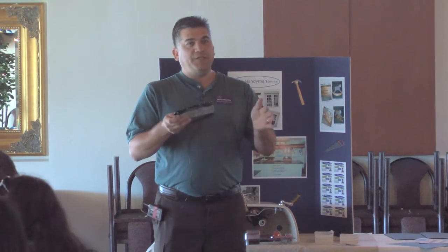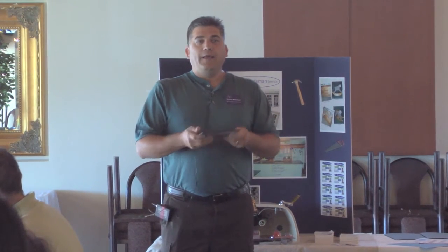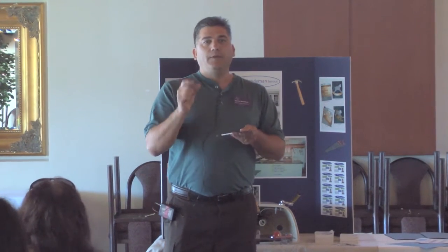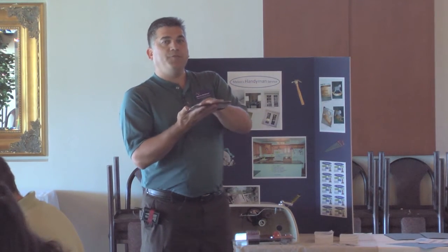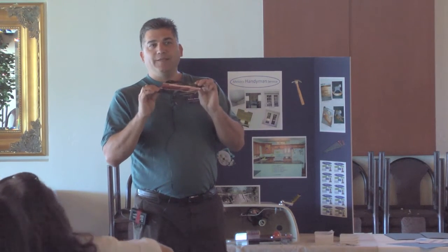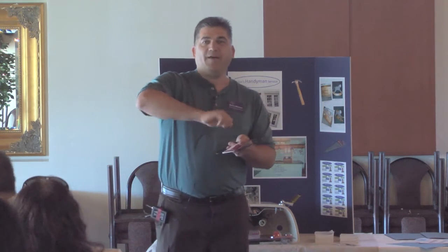The cause for this is toilets that rock a little bit and you can feel them moving. All that seals the water between your toilet and the drain is a piece of wax. It just gets smashed down between the toilet and the floor. And when the toilet starts moving a little bit, you start breaking that seal, water starts getting out, it'll actually rust away these metal plates. And the plastic plates are even worse because they're just not strong enough. People crank down the bolts and pull them right up through the plastic.